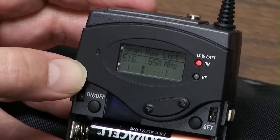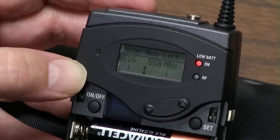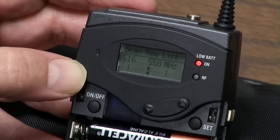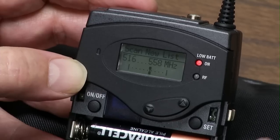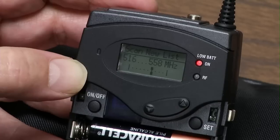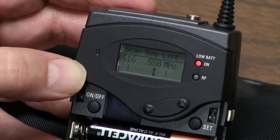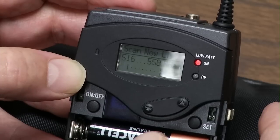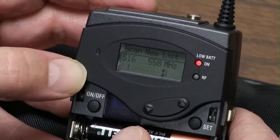However, if you do it away from interference and then you come down and you're mixing audio right next to a big monitor or you have your cell phone sitting right next to this, that could cause you problems. So make sure you have a two- or three-foot area where there's no other electronics. Mixers like a Shure mixer really don't put out any interference for wireless mics. We're almost done — we've scanned a list here, and we're just about at the end of the scan.